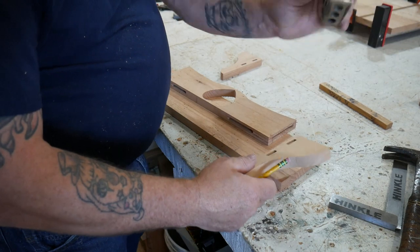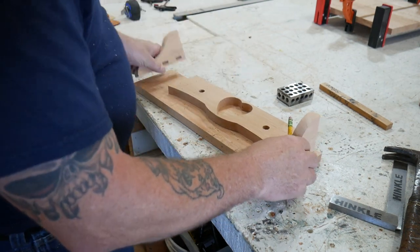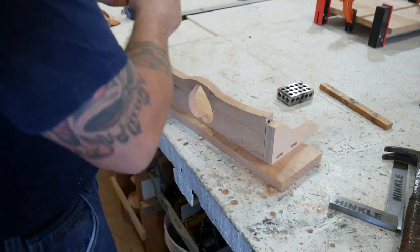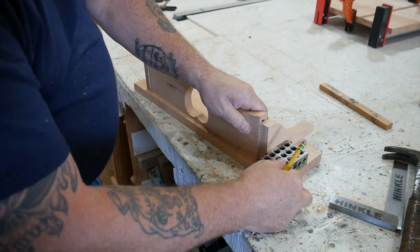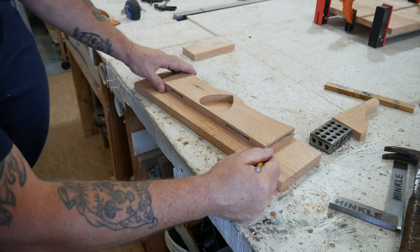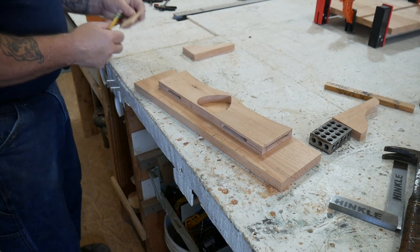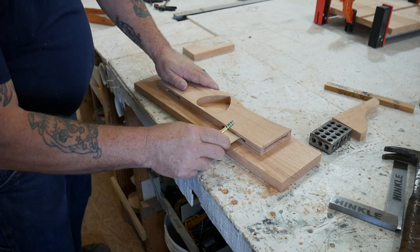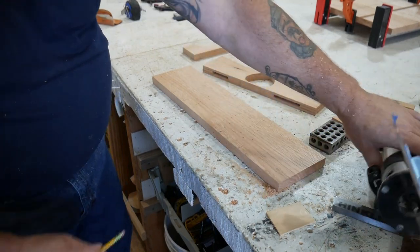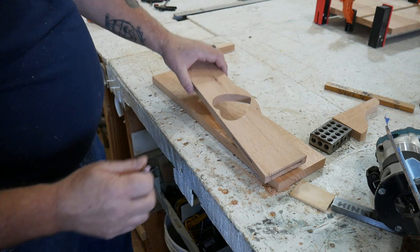To make things simple, I took my one-two-three block. These go in now — easy peasy lemon squeezy. They'll sit on there like so at each end. A one-two-three block on each side gives me two inches of overhang. Mark the corners — got that done. Mortises are here; line up the outside edge with the outside edge. I'm eyeballing the mortise positions because this is a floating tenon — it'll be able to move back and forth so I can position the back correctly. Now we know where everything goes: cut the mortises, make some splines, glue it together. I'm also going to round the corners with a roundover bit so it matches the other piece.